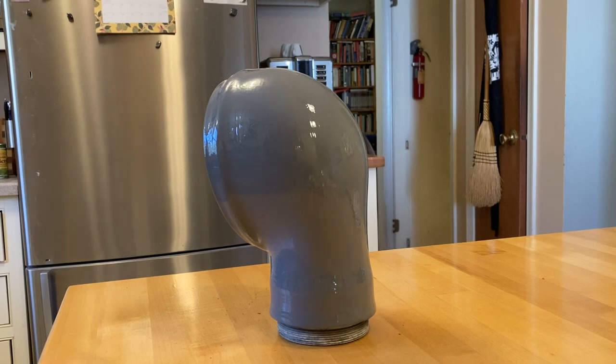Okay, that looks pretty good. I think it's 2 hours until, let's see, 2 hours till you can touch, 16 hours till you can sand, and you can overcoat it the minute you can sand it. So yeah, basically tomorrow morning, I can start putting the blue on.